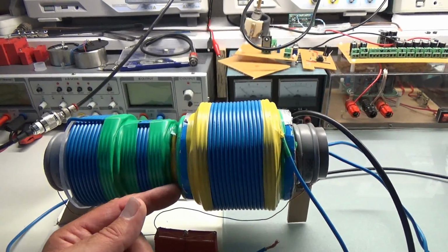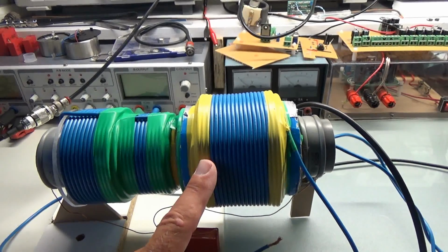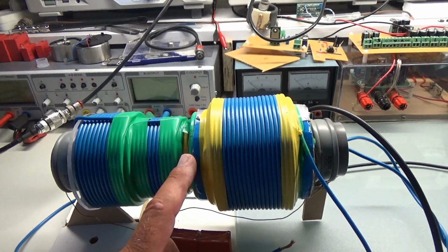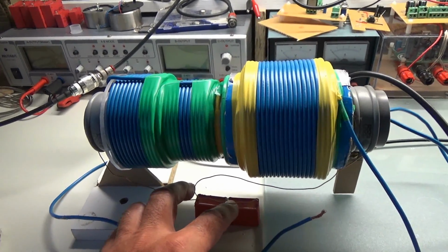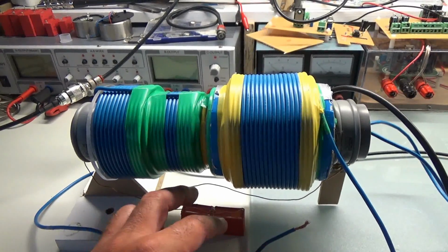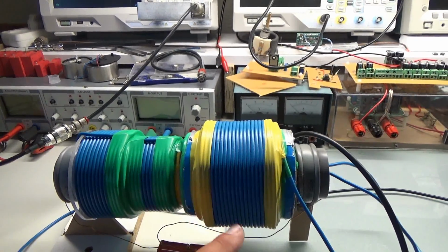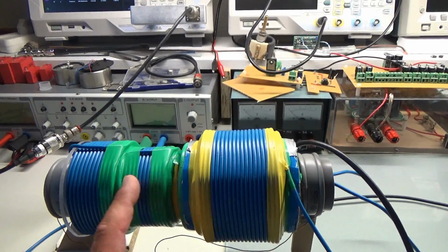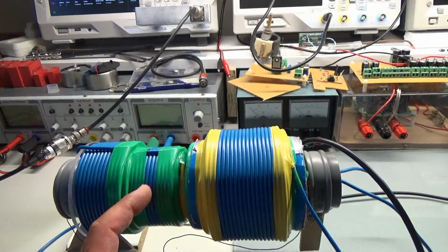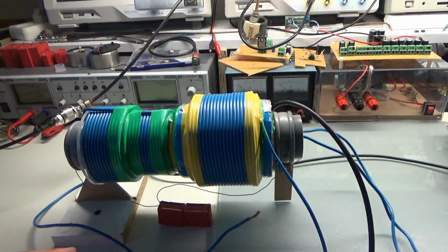So I changed then to add again the inductor, 3 layers bifilar, which is on top of the nano coax cable, and drive this with the push-pull, and having this Tesla coil underneath in a kind of parallel resonance, not connected to anything, just to aid in the resonance of the total stuff. But same issue there: almost no transfer from both the unconnected Tesla coil and the push-pull bifilar inductor around the coax cable. There's almost no transfer into the grenade coil, so no lights were lighting. So I guess this does not work in my case, so I kind of stopped with this.